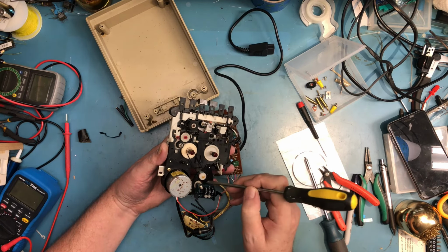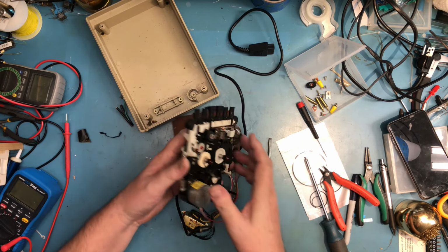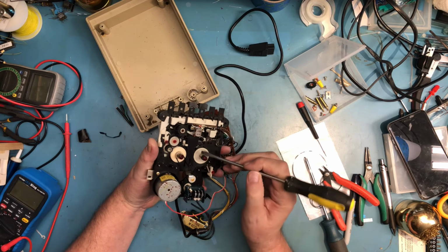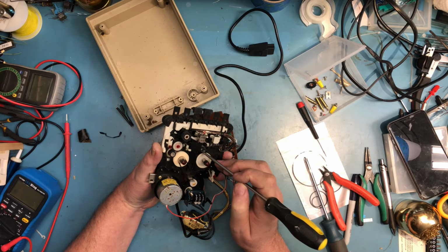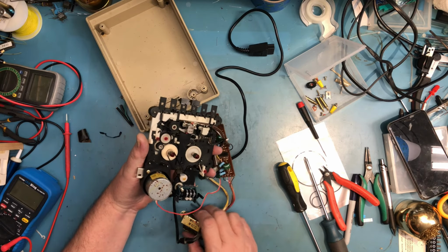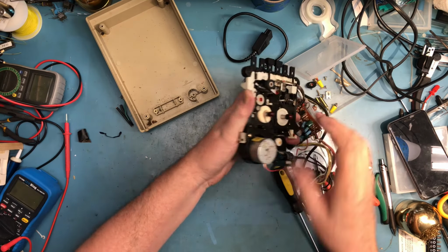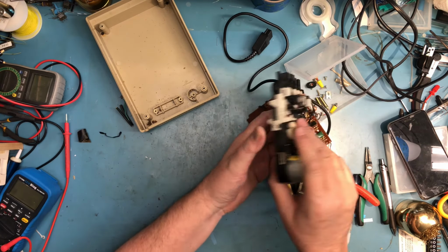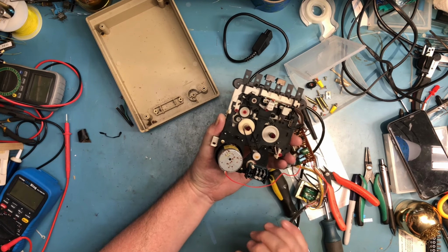Two of the belts deal with simply the tape counter. There's one here. One that we look at underneath. There's the main belt that'll be really easy to get to here. And there is a belt inside here that's going to be tricky to replace. So it'll really become a matter of how far down I dare tear this thing. I've also got to be careful here, like on the printed circuit board. There's a couple of switches here. We don't want to catch those in something and bend them up. There's a mechanical switch sitting in here. We want to be careful we don't mess it up.